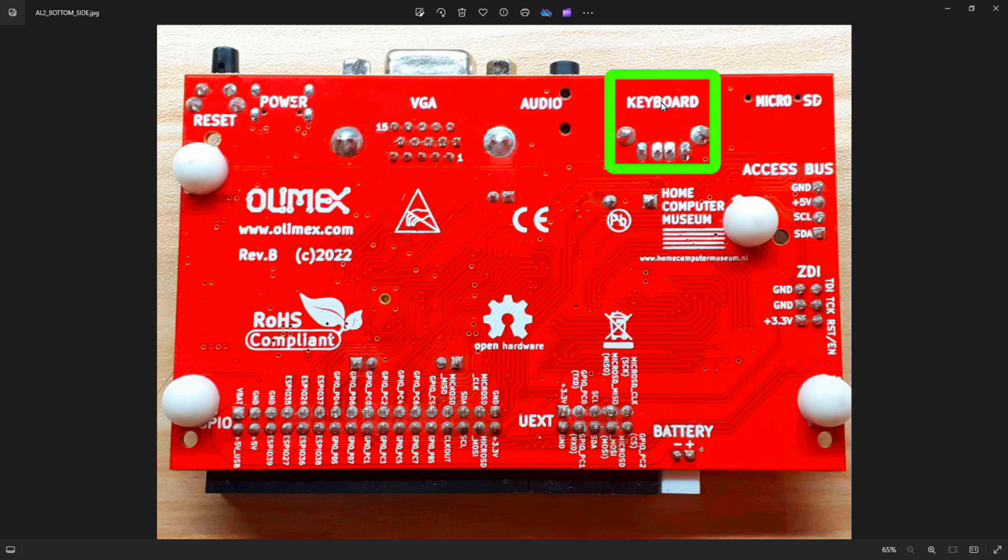The keyboard. Although this is using a USB type A connector, this won't work with the majority of keyboards that you'd normally have on your desktop or a tower computer. The reason for that is it's not using USB protocol, it is using a standard PS2 protocol from back in the day. Like the HDMI versus the VGA, if they had opted for a USB protocol, it would have meant much more complication, and you'd need more hardware to cope with it. So you're going to need a keyboard that runs PS2 protocol and is either a PS2 connector or a direct through on USB using PS2 protocol.